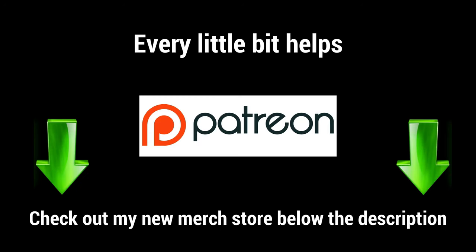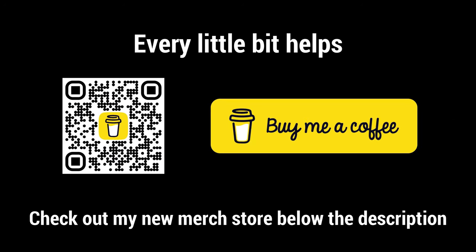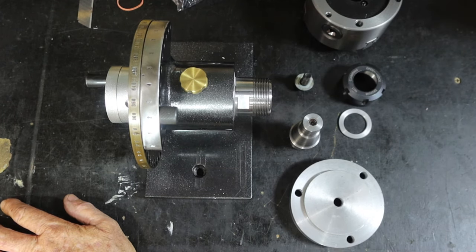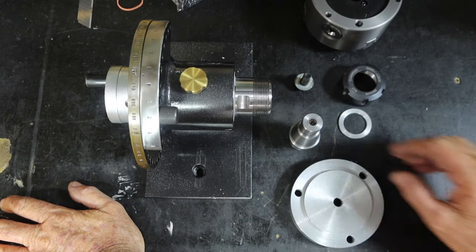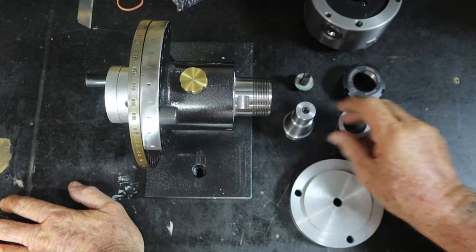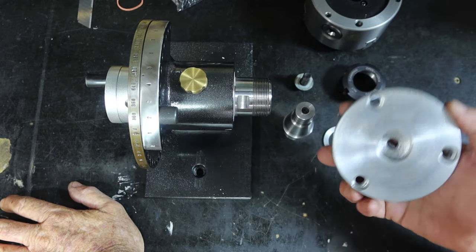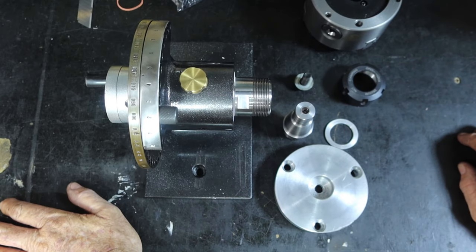I'd like to thank my patrons for their continued support — it's greatly appreciated. If you'd like to become a patron there's a link down in the description. If you don't want to be a patron there's always Buy Me a Coffee — there's a QR code on the screen — or there's the Thanks button. Thanks to all the electrical problems this video has dragged on a bit too long. While you weren't looking this morning I drilled and tapped that M10, shortened it up five millimeters. This afternoon I made up the aluminium washer, and this morning I drilled and countersunk the holes for the chuck — so let's put the damn thing together.